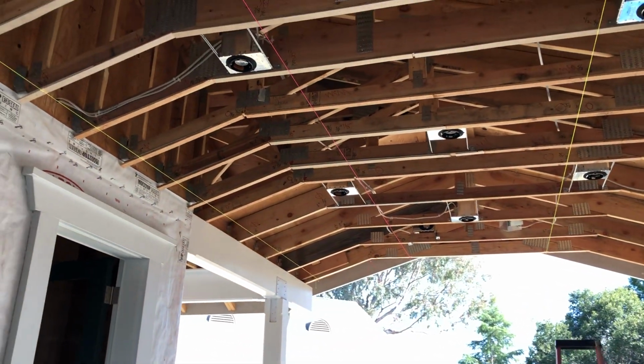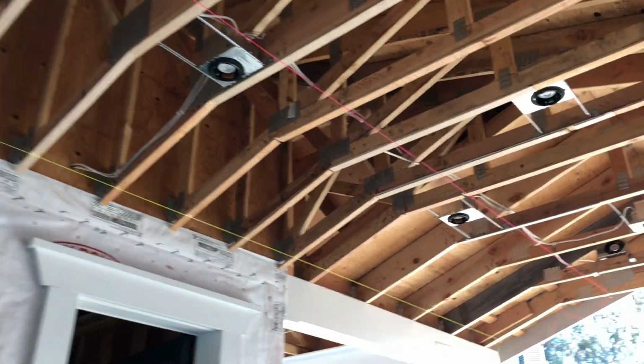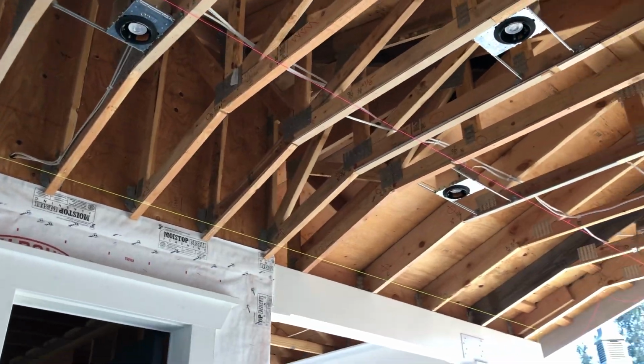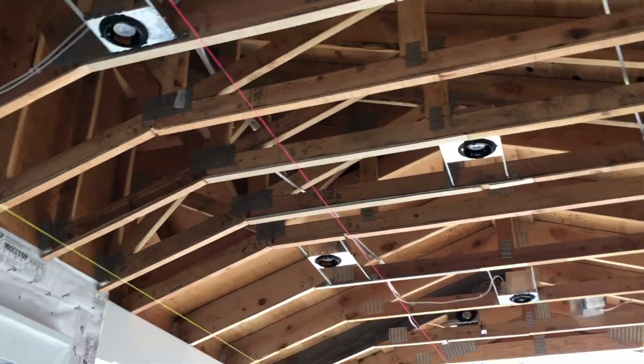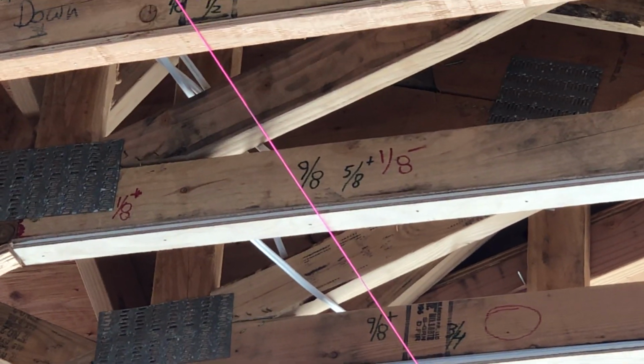Anyway, because of all the geometry issues, they've had 10 different sizes from E1 to E10. What that means is that they have to change the jig a number of times, and each time they have to change it, there's a little bit of error introduced. So this part right here just happened to be the furthest off.